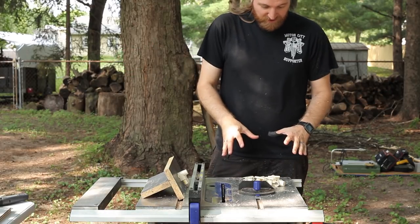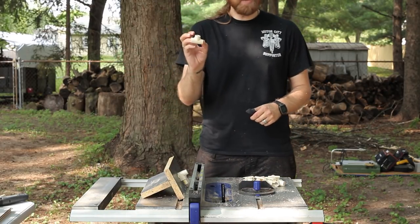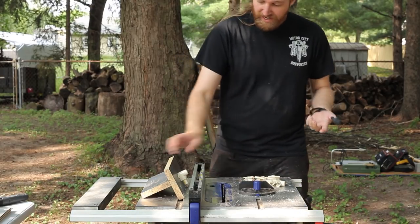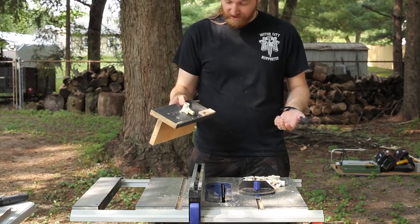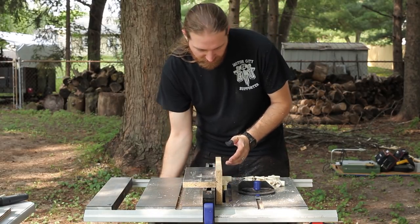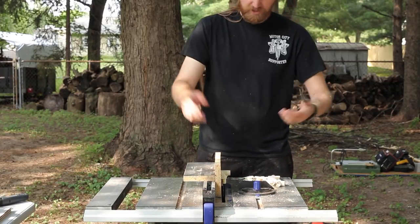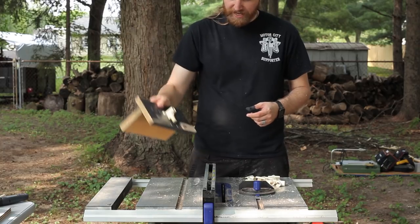All right, so those are all sanded and safe. So we have our half inch CPVC custom made snap fittings, which is awesome. And I have a great jig so I can make them in the future if I ever need them. I also went ahead and put a little piece of wood on here, which will give me the right width on my fence. So I just put it in, set it there, and then I'm good to go. So this is a fully functional jig, which is great. So I'm definitely gonna hang on to this.